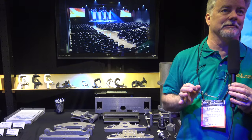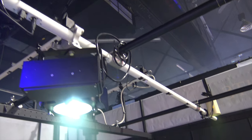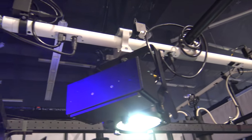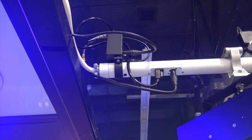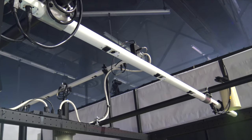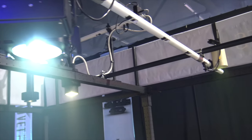And then we have a brand new product — this is what I really wanted everybody at home to see. This is our new power data pipe, with built-in power and data outlets every 16, 18, 24, or 36 inches. It'll have up to six circuits of power, but you can have just one. You feed it with DMX — that box on the end is a repeater, so it immediately repeats the signal and you've got a data line. You hang a fixture and plug it in right next to where you want it. You can clamp right over the outlet, put this on a crank-up stand, hang your lights, and plug them right in. It makes it look clean and easy — you just bring a power and a data line up to each one and you're done.